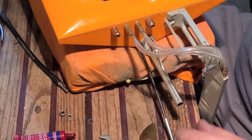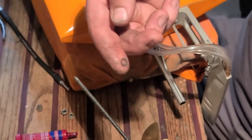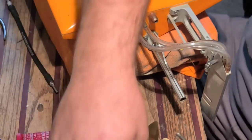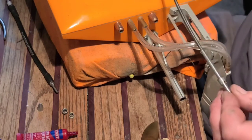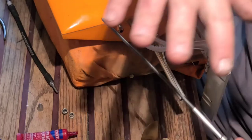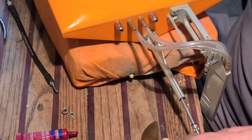Okay, I'm back. Got the flex cable out. I was grabbing the thrust washer, and all you do is put it on your cable before you slide it in the shaft. Now, I just want to say that this will be greased once we get the shaft in there and before we put it in the water, but I'm not greasing it now, because it's messy once you get grease on it. But you just slide it in there, put it in the collet.